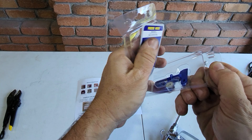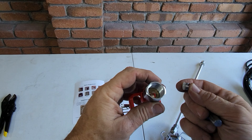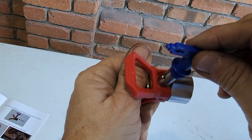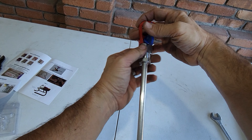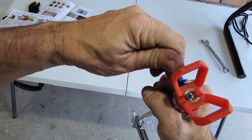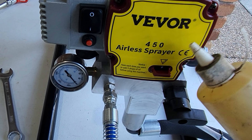Now checking out the 517 airless spray head. This seems to be a generic one for painting walls and once I figured out how it all works I was pretty happy. You insert the small component and then put in the spray nozzle itself. You can turn it around — one side gives a wide fan spray, and when it gets blocked up you turn it around and unclog it with the more narrow fan spray. It recommends putting in some oil — I just use air tool oil, a couple of drops, to keep the motor lubed up.